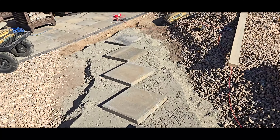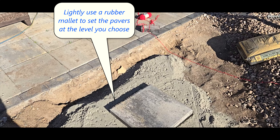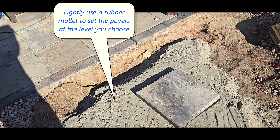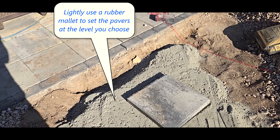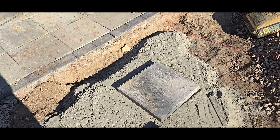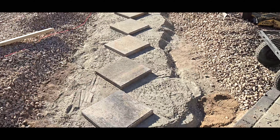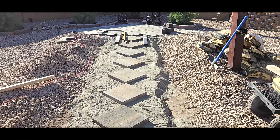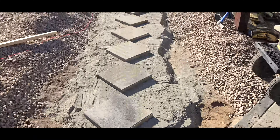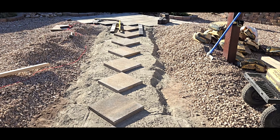The cement is still dry — it has not yet been wet. But once you set the pavers on it, they sit. They feel more locked in place being on top of the dry cement than they do on leveling sand. I'm not nearly so worried about walking on them as I would be if it was just sand — just sitting alone like that, they just don't move. Next time I fire up the camera, I should have all the 16x16s in and have a good start on the 4x8s.